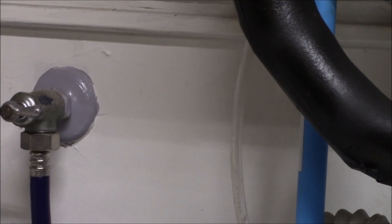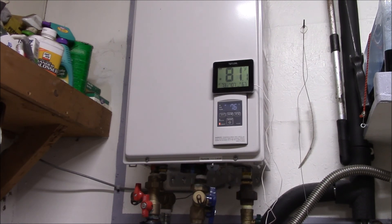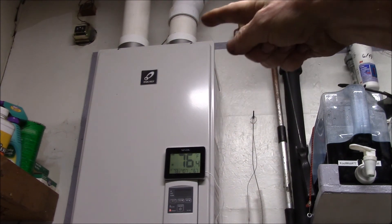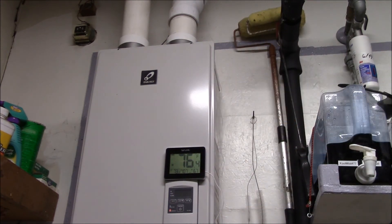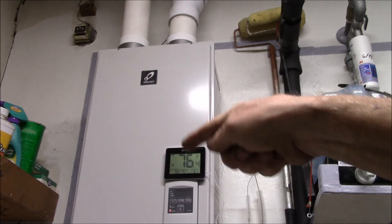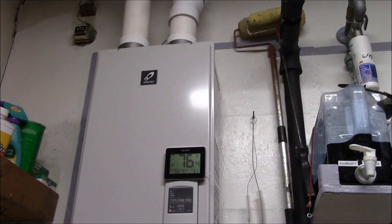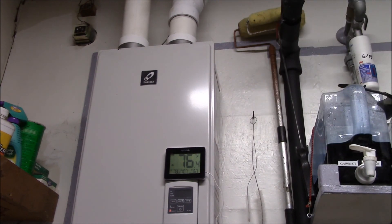You can probably see a few little water droplets on the condensate line — it's pulling water vapor out of the exhaust, and that's how it gets the extra efficiency. This heater is rated at 93% efficiency as a condensing unit; if it were non-condensing it would probably be around 80% efficient. It's not just an accident that you can use PVC venting — the manufacturer had to design in features to make sure PVC venting is acceptable, add a temperature sensor, and test that it works. So if you have any other questions, post them in the comment section below, and as always thanks for watching.